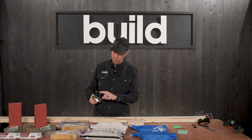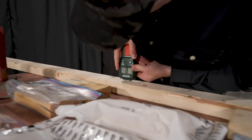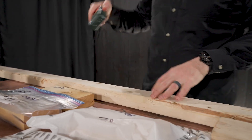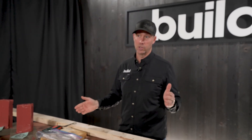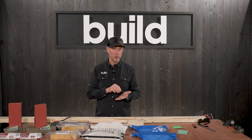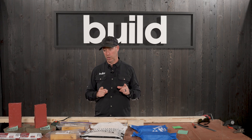This is a probe style, and I'm going to try and insert the probes as far as I can. This is showing about 8.7, 8.6% moisture content. That means that this wood is pretty close to equilibrium and is about as dry as it gets. Wood that's in our houses that's been air conditioned and is dry is something between maybe as low as 7 or 8% to as much as maybe 12% moisture content.